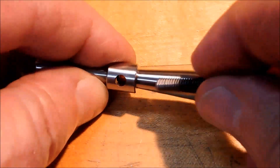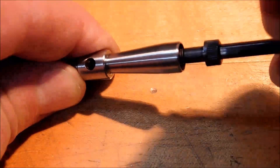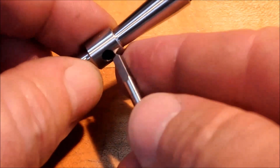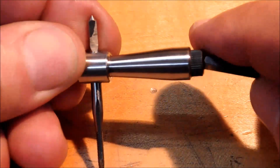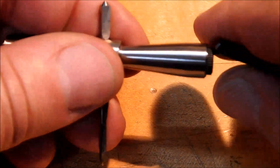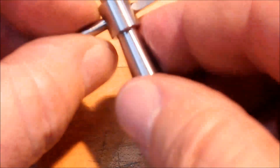Do not let this neck diameter get smaller than the screw or it will snap off. I like to use a big screw — that way you have a nice driver for it. This is a number five tap. If you're tapping a material and you're afraid you're going to snap the tap off, when you torque down on this, torque down on it very gently. That way if the tap binds, the handle spins on the body of the tap — it's a little bit of added safety.